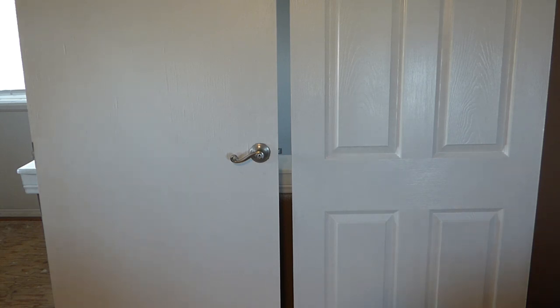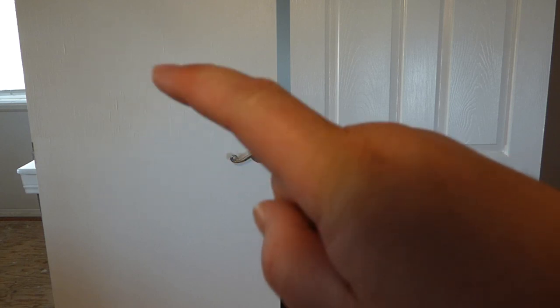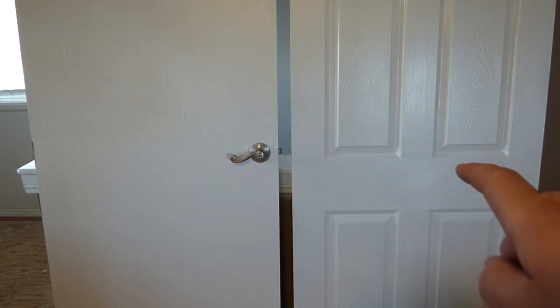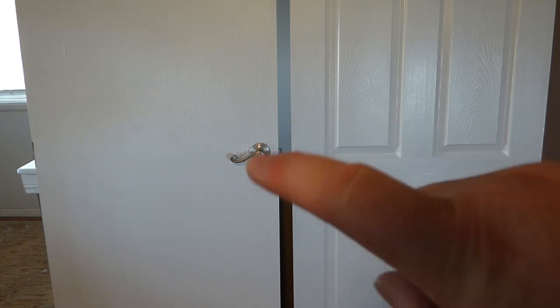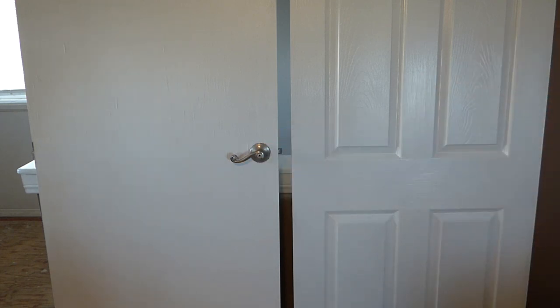All I've got to do is make it fit right. Things you can't really change — or don't necessarily want to change — is that the hinges are already installed in the door frame. So we're going to transfer the hinge information from this door to that door, and then the knob. There's also the little door stopper so it doesn't hit the wall — the spring thing — that will probably be transferred over too. The door on the right, as it comes to you, usually has a cheap little prime on it. So we already primed, painted, and let it dry.